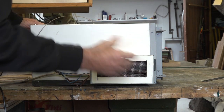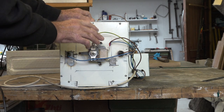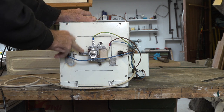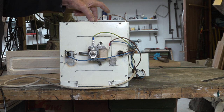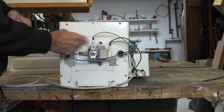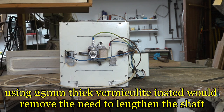I put this wire meshing on just to allow air movement through. This is the fan end — the fan is from a normal domestic oven, which I got from my friend around the corner who owns a little hoover and washing machine repair shop. The shaft on it was only short so I had to extend it, because there's two inches of insulation on the back of this. All I did was spin up another shaft on my lathe with a socket, pushed the shaft into that, and applied some superglue — the superglue is actually inside the refractory material so it never really gets hot. That made a shaft extension about two inches long, which puts the fan about an inch off the back of the oven.